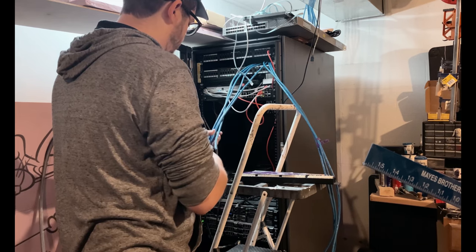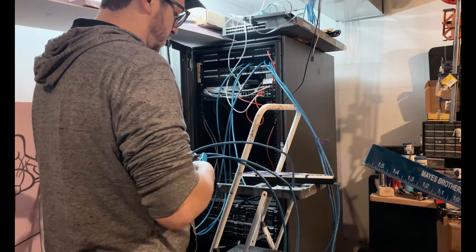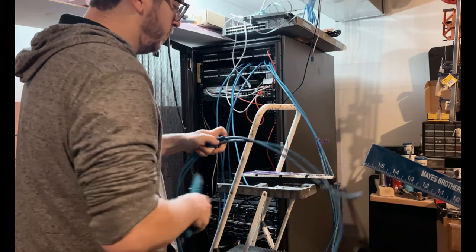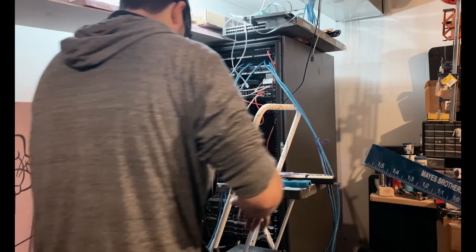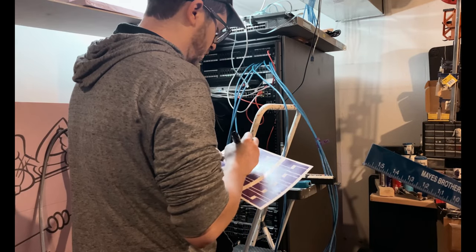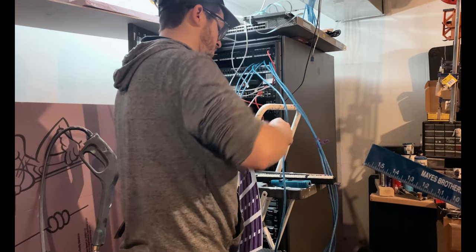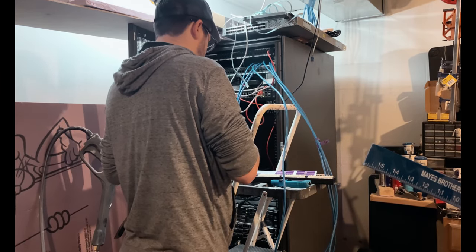Here I am just trying to find that tone on the other end of the cable — and there's the tone, so I found the cable I need. Now I'm just going to stick a label on it. I'm only doing desktop one through four; those are the only ports I'm really concerned with. Just attaching this so I know which one it is and which order to terminate it on the patch panel.